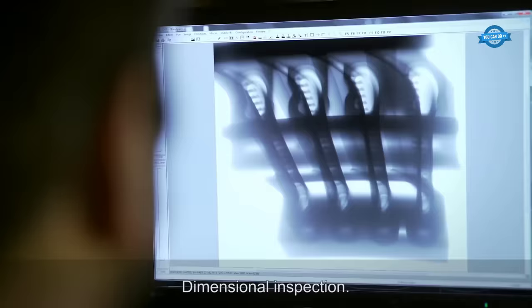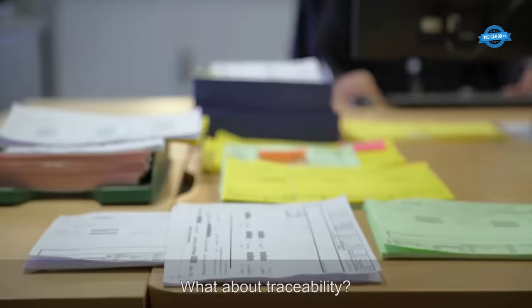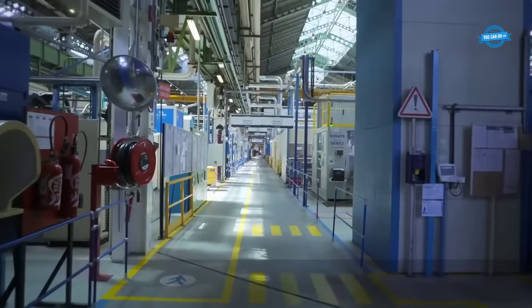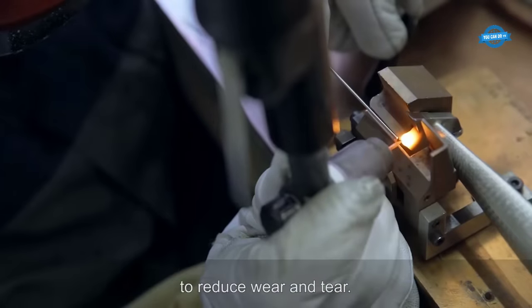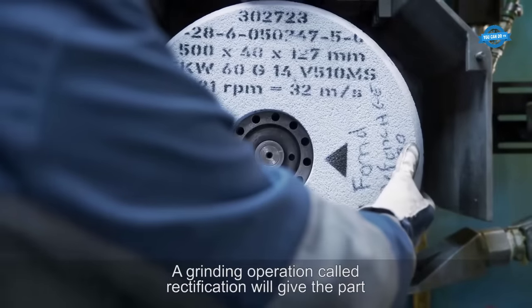Additional components, like small complementary parts, are attached to the blades using solder beads and melted into place in furnaces. The same furnaces are also used for heat treatments and thermochemical treatments, which optimize the blades' properties for high-performance applications.